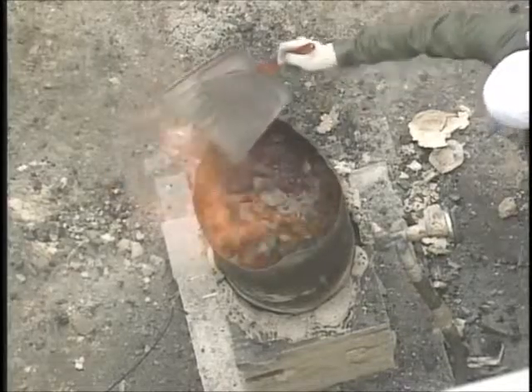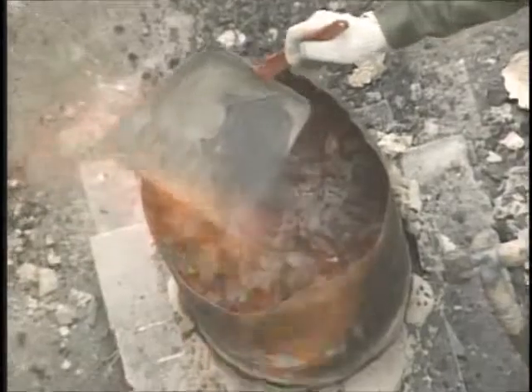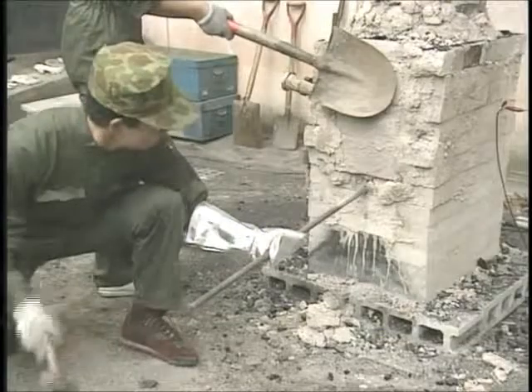After changing the air input to the top opening, we add charcoal and one kilogram of iron sand together every 10 minutes. Inside the furnace, the iron sand sparkles in its molten state on top of the red glowing pine charcoal.